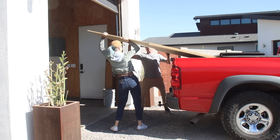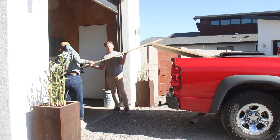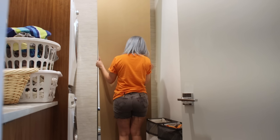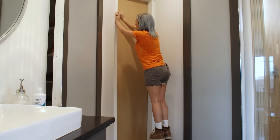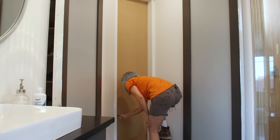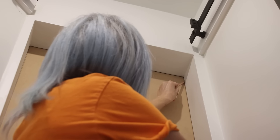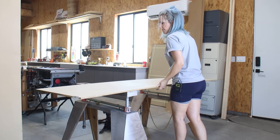For the main faces of the door, I used half-inch MDF panels that I had ripped down into two-foot by eight-foot size. Anybody who's done trim carpentry knows that no walls or opening in a house are perfectly square. In order to get the tightest reveal or the smallest gap around the door, my best option was to trace the opening of the doorway onto the MDF panels themselves and basically build the door to the opening instead of just using measurements.